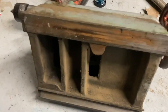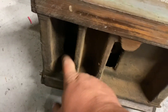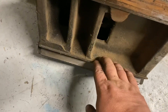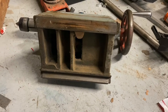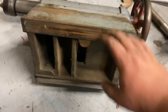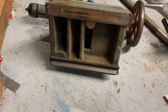Looking at the bottom of this, I'm very encouraged. All the sides are solid, straight back to the top of the plate — same here. You feel in there, they're all solid. It tapers in just a little bit, but we can go more this way — there's plenty of thickness here. The flat spot just has to sit on the flat spot; we have to get the V-way in its place. We don't want it too thin on the outside. In the next segment I'll pull all the top part off and mount this on the shaper and take a couple passes.